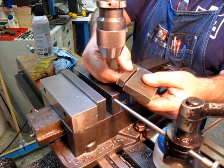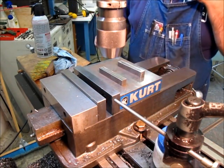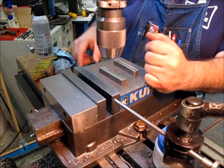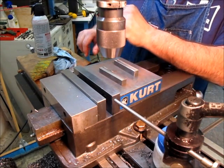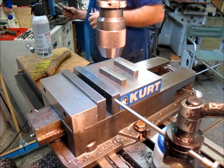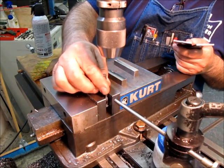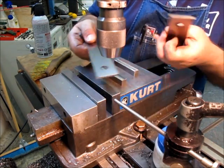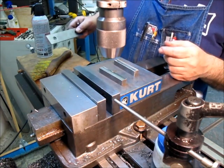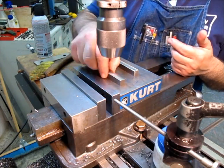These are the mating pieces for the clamps. So we're going to do those now, but these are only half inch wide, so I have to counterbore through. And one thing that sometimes happens, people forget about the drill that's going to project through, and the clearance around the parallels. So sometimes you look at the shop parallels and they're all chowdered up, because a lot of times you're not thinking about what's below what you're working on.